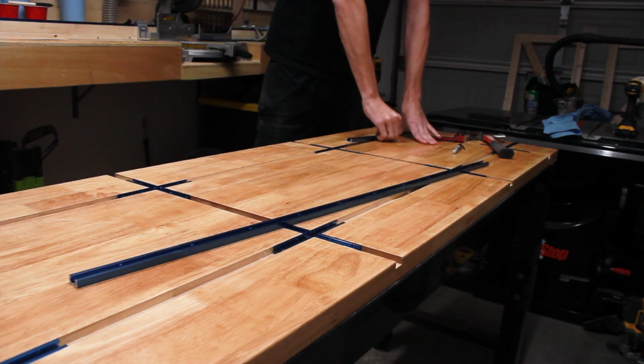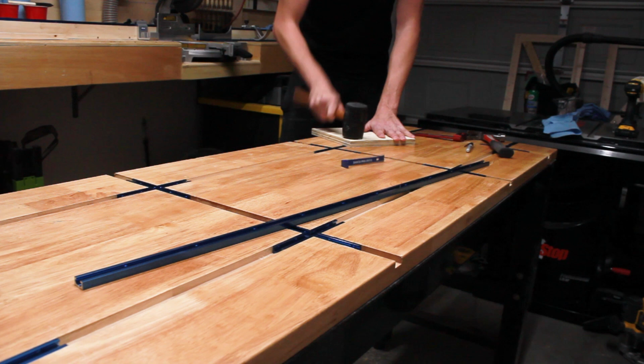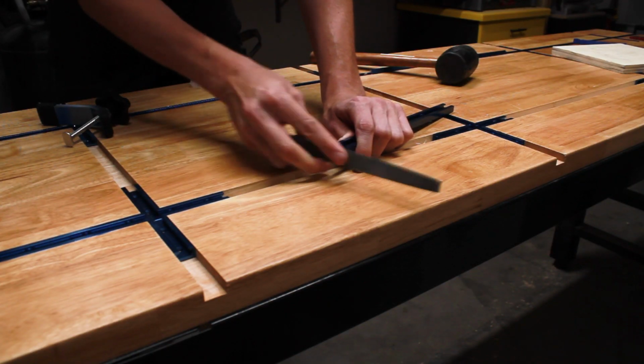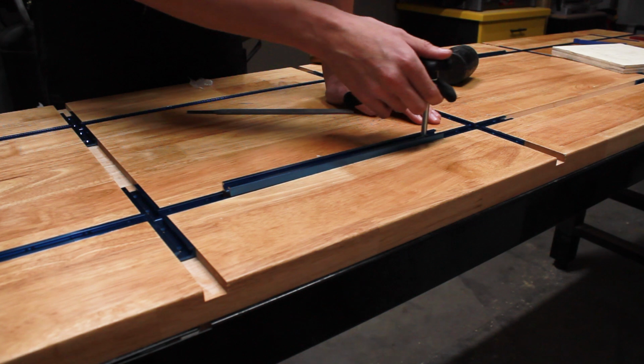This allowed me to have perfect hole spacing that was centered along every 6-foot piece, and same for the 2-foot pieces. All the way across the board, all the holes fall in line. One of the best techniques I found for fitting a piece is to cut it slightly oversized and file it down till you get a good fit.